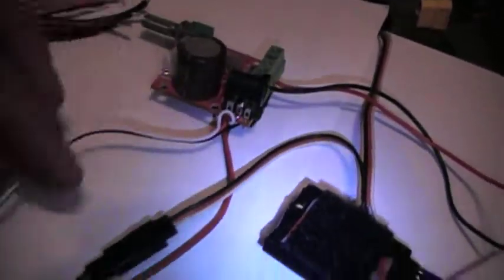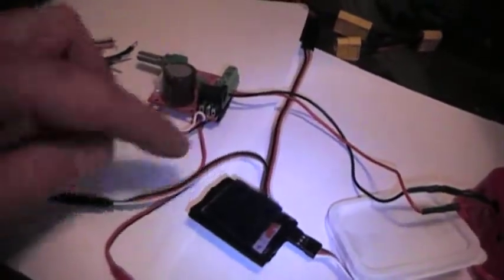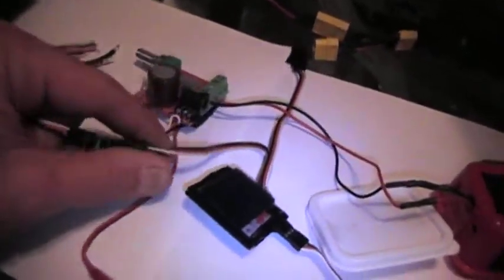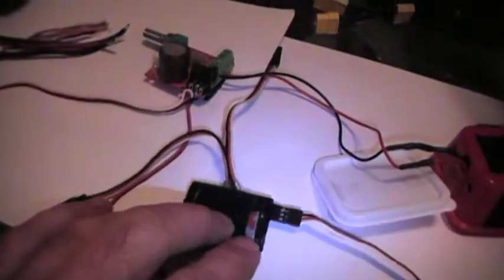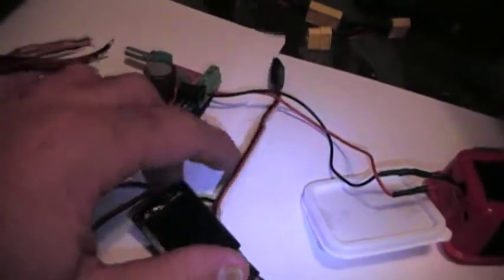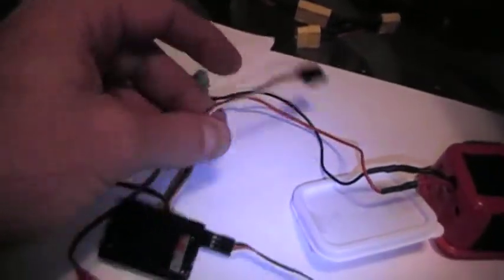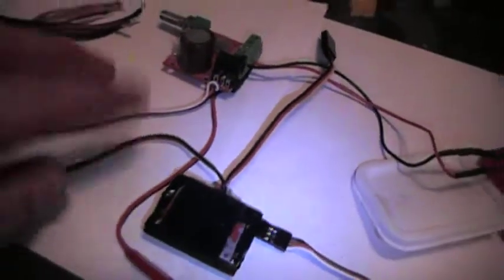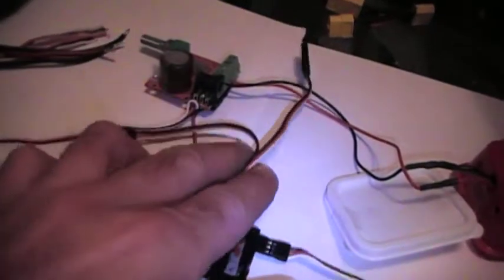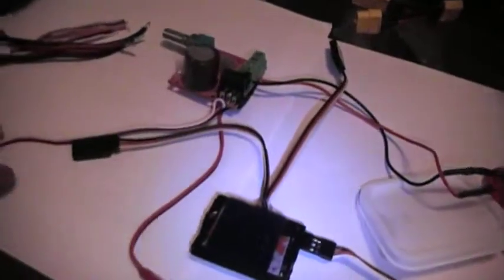What would have normally been the lead that goes from the amplifier to the sound card — I took a servo lead, which could be an extension, cut it in half and put the female end on the sound card. On an A module there would only be one lead coming off here. On a Pro version there would be two because the other lead would go to your sound card. If you put two leads on the sound card, be it A or B, pro or budget, you can effectively take this card and the gun card and they can fit any version you want.